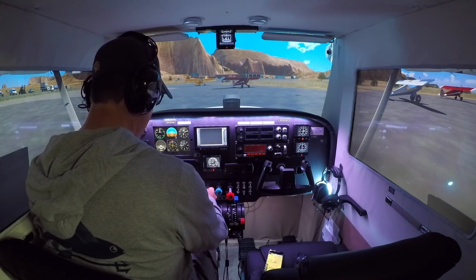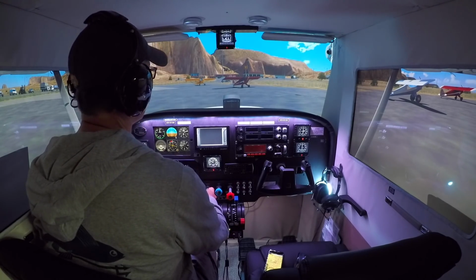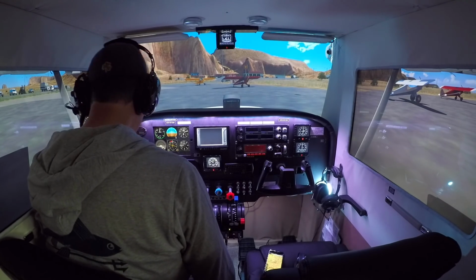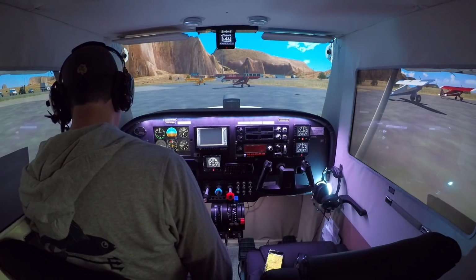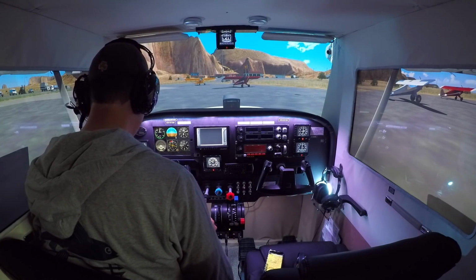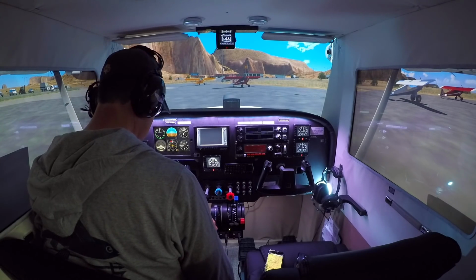We lower to about 1,000 RPM, 800 RPM, which is where we are. We have our parking brakes on, so we're not going anyplace. Check for our oil pressure. It's up and normal. Oil temperature is coming up. We've got gas. Fuel flow looks good. Vacuum pressure is good. Amperage is good.